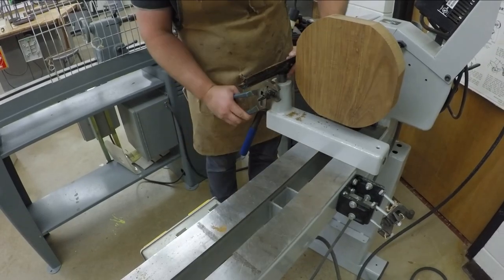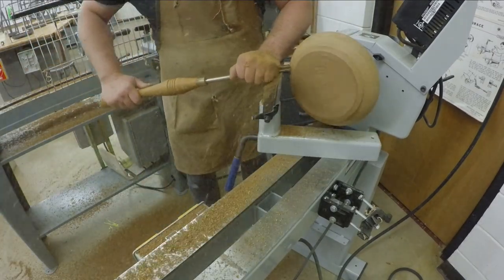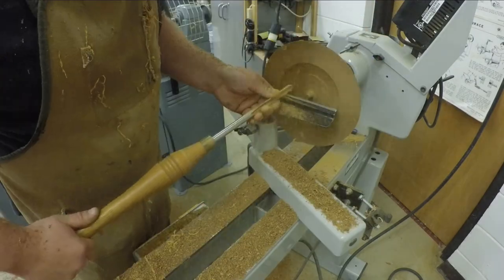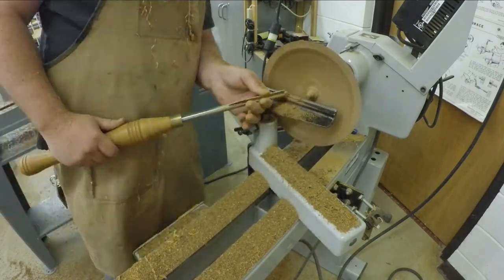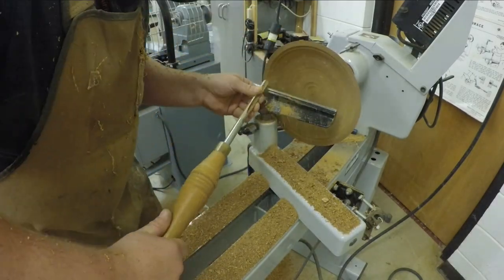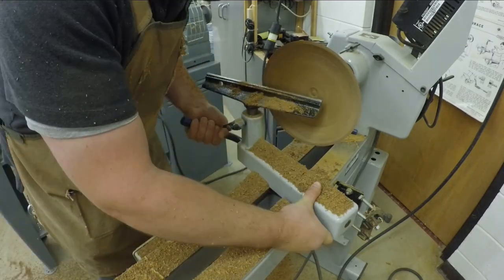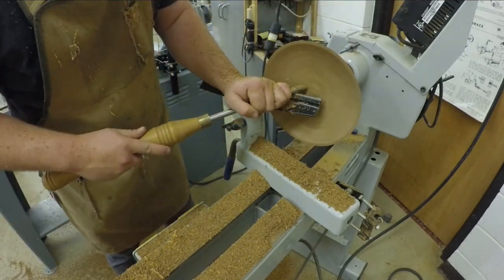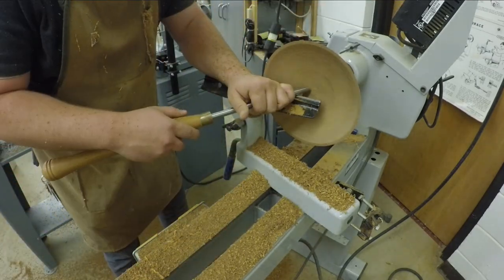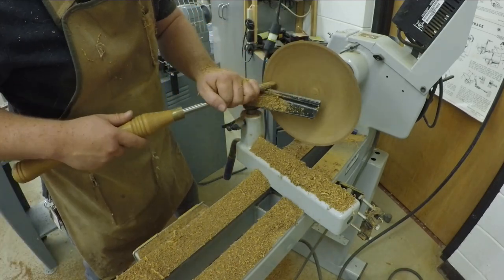You might be wondering what exactly it means for a piece to be thermally modified. Thermally modified essentially means the wood has been taken down to 0% moisture or extremely low moisture via a different drying process than a normal kiln. They heat the boards up — this can be done to different species — up to an extremely high temperature where wood would normally burn. The way they prevent it from catching fire is to remove all of the oxygen from the area where they're drying it. There are several different types of processes for thermally modifying boards, and this is a nice alternative for furniture or items intended for outdoor use or long-term durability.